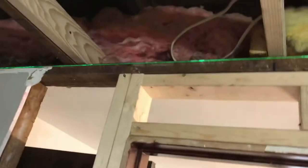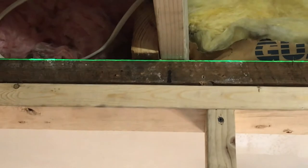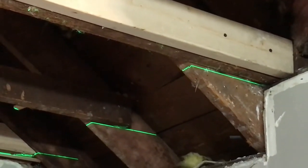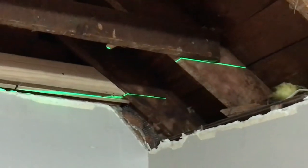Here's an example of how I'm using this laser level to get all my joists perfectly level. Right here is my lowest point. That one's good, that one's a little high. Over here I'm good, right there — I'm looking good, looking real good right there. But over here I'll have to drop that new joist I put in there.